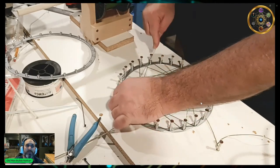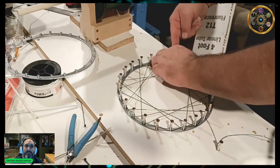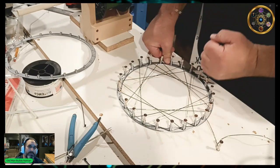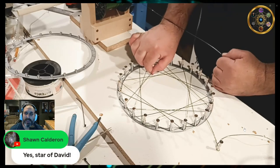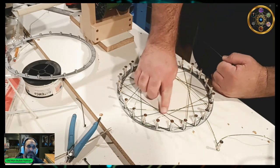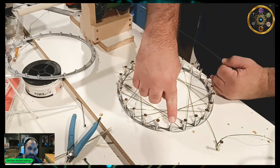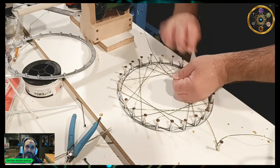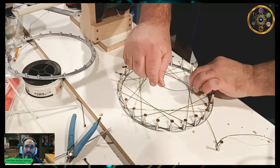Basically, we have 24 screws, and that's on a 250 millimeter winding, the diameter of the round shape. So you can kind of configure what it is there. I usually build these things in my head, or lay them out on the computer, and then I wind it out. I should have written it down, I would have gone much faster, but I don't know. I don't like reading notes even when I write them. So I just go with the flow and see if it works.